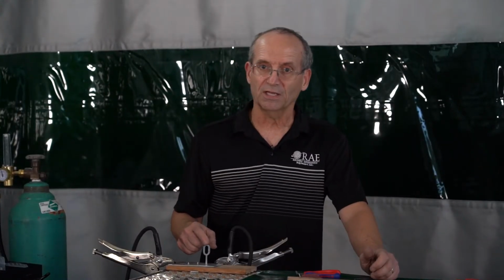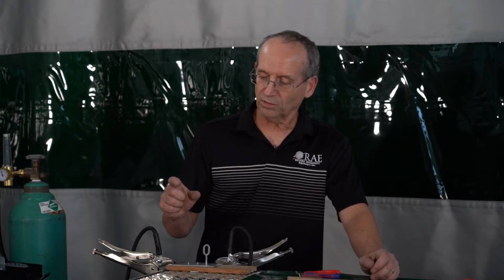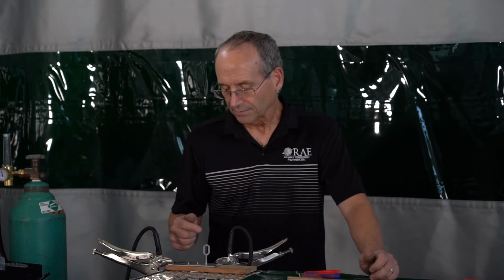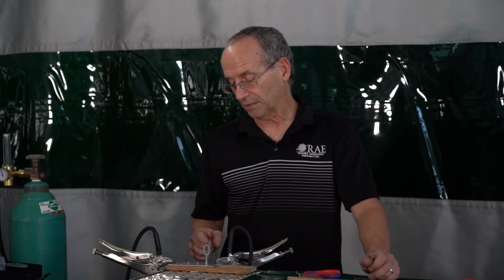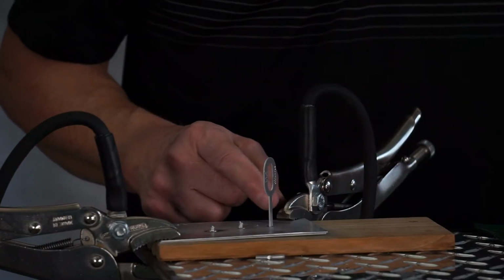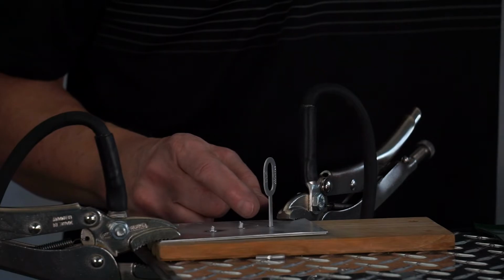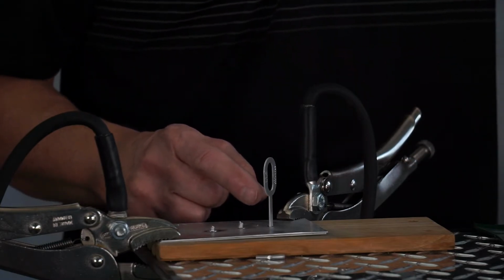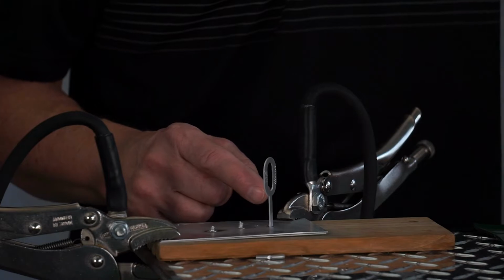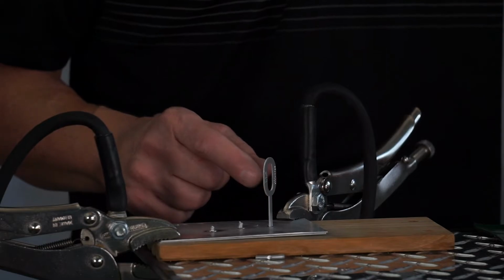So if you put some tension on the puller, start putting some heat on the panel, your little infrared thermometer that comes with the system, keep control of the heat of your panel. Audi's official thing on this is you cannot overheat your panel over 302 degrees Fahrenheit. If you get your panel up around 225, 250, right in that range, you'll be surprised how malleable this becomes, how it walks right out. Pretty simple. So your process on pulling out aluminum is going to be a little bit slower than steel. It's not going to come out as fast, but you have to finesse it out.